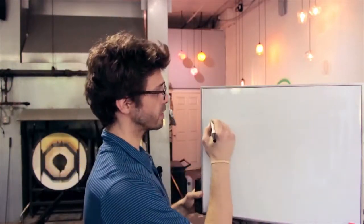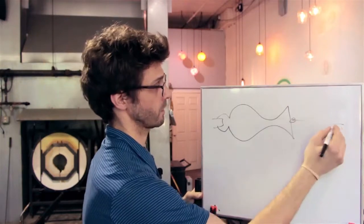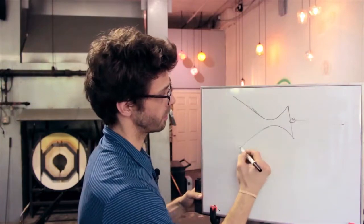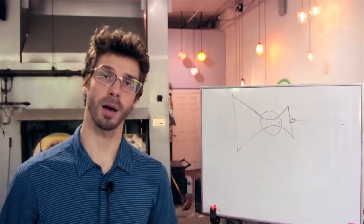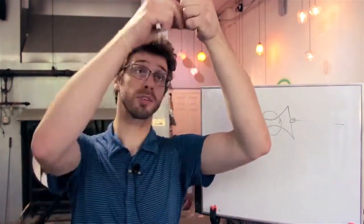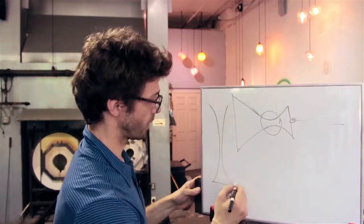So there are two ways of making the shape, and I'll show you one more. This third way involves doing a lot of work on the punty — creating that stretch, that middle section, on the punty. You're going to blow up a shape, punty something up, finish the top part and the bottom part, get those two parts looking how you want. But the middle isn't going to be how you want yet. So what you're going to do is heat that middle section up, either with a hand torch, a bench torch, or by heating it in the glory hole, then come out and hold the pipe or punty straight up and down so that gravity is what actually stretches that material out for you.